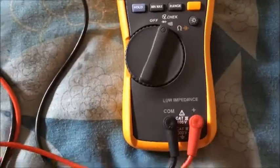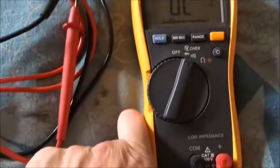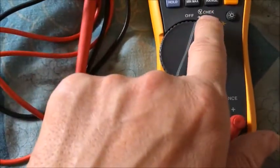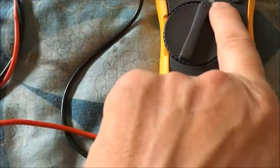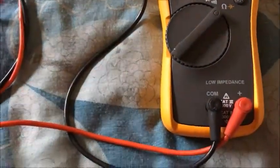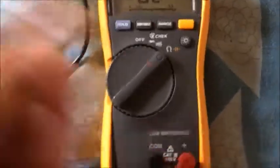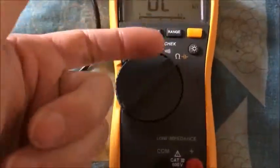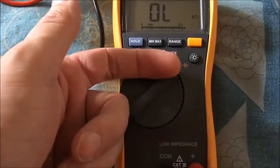It's pretty basic but it does volts AC and DC through the volt check, which is pretty handy. It automatically switches between AC and DC which is handy. It's also got diode and continuity mode, ohms and capacitance. So when you think about it, even though it looks basic, it's got pretty much everything you need: volts, diode, continuity, capacitance and resistance.